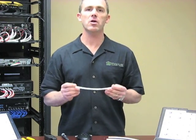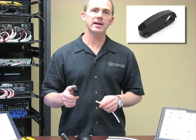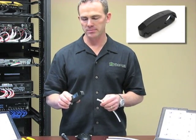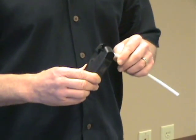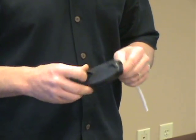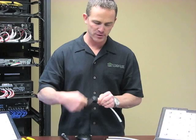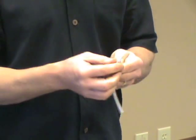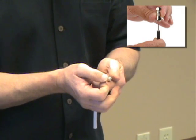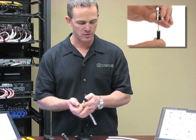In this case, I've got a piece of RG6 Quad. I'm going to take the new Planet Waves SS-FBT strip tool — it's a single-step strip tool, available on the PwCIS website. I'm going to insert the coax cable into it, and just like any other strip tool on the market, go back and forth a few times. But what's unique about the Planet Waves solution is when I remove it, I don't have the shield and the braid that I'm trying to bend back to prep for a regular type F-Connector.